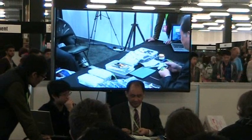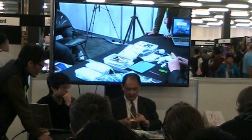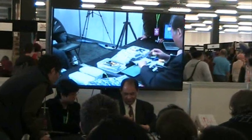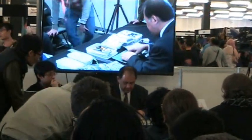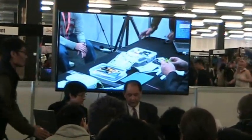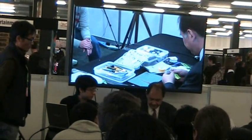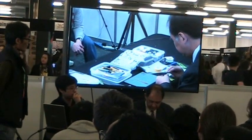This time on a beam shield, the technique is similar, but you need to consider the direction of sanding instead of sanding the whole surface. Okay, so this time to make the effect easier to see, we'll just sand only half of this piece, so then we can easily see the difference. So just using masking tape to prevent getting scratches on one half of this particular beam shield.